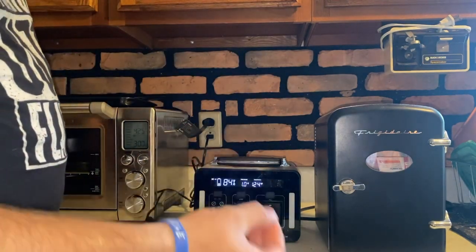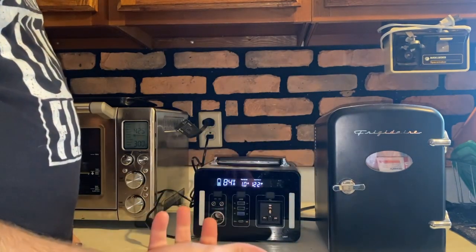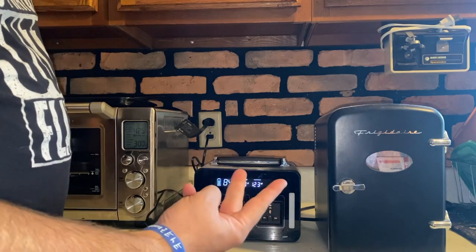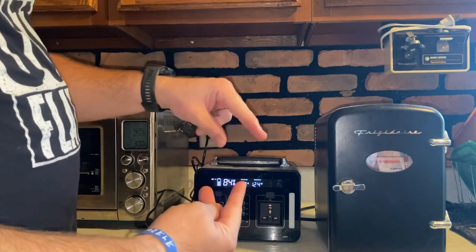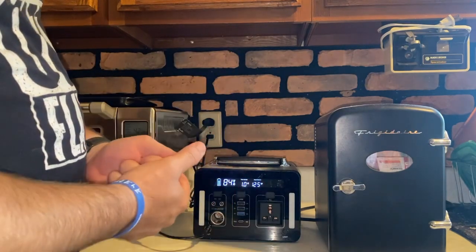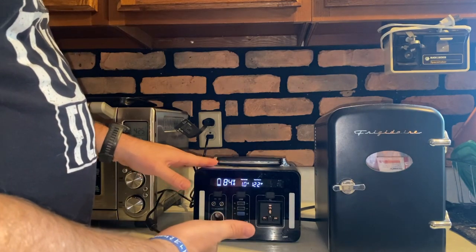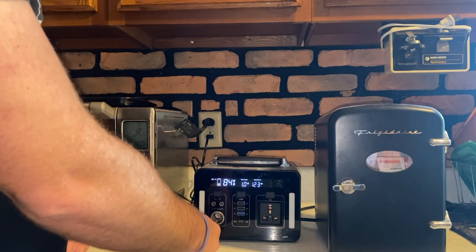The jacks that go into some of these are between 5 to 8 millimeter. You can actually get those at Goal Zero — I can put a link in the description below — where you can get that, and it actually spans out into a jack where you can plug in like a 100 watt or a 50 watt panel into the MC4 connector, which is really cool and helpful. For charging this up, because some of these will accept like 5 amps worth of power in, you can plug in like a 100 watt panel into a jack and put that into the DC input.